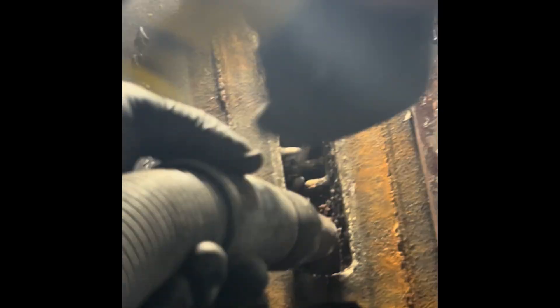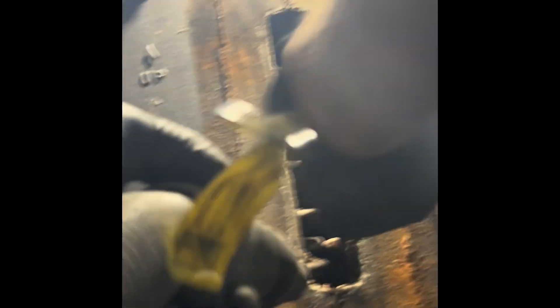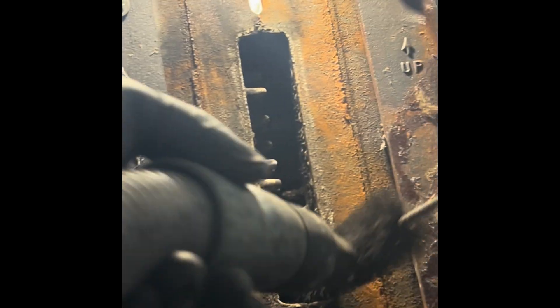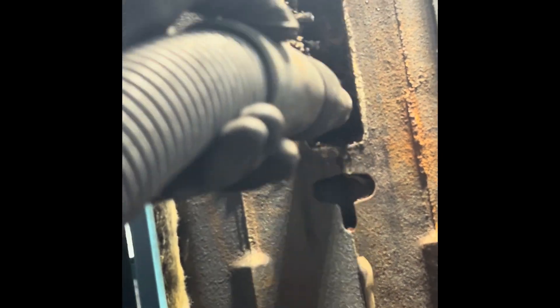Fortunately it was more of a dry, crusty soot, so it fell apart and fell off — unlike fluffy, wet, or sticky soot, which is terrible to clean. With a boiler that's moist, condensing, or in a damp environment, those are very difficult to clean. You just have to run them, fire them, and make them hot enough to finally be able to brush that soot out.